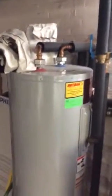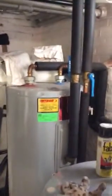There's indirect hot water off of the geo system here, so it's just using that as a preheat tank. That all will stay plumbed pretty much the same way. The outlet of the preheat tank there will just feed the supply of the new tankless water heater.